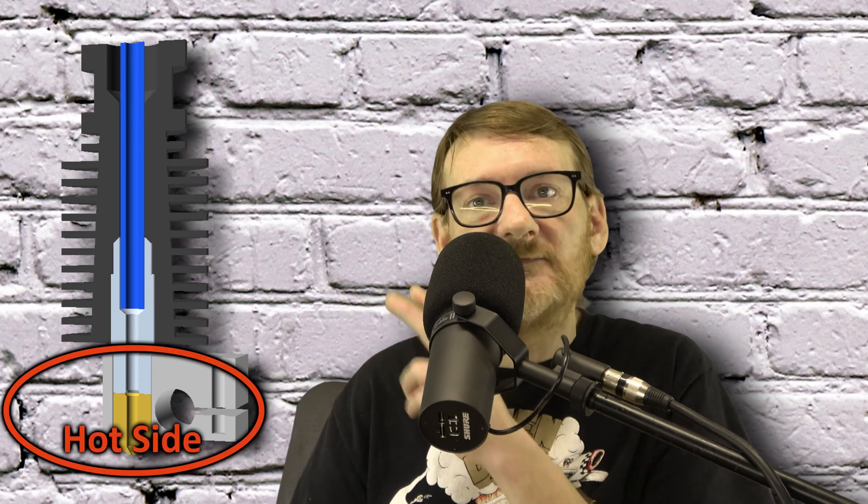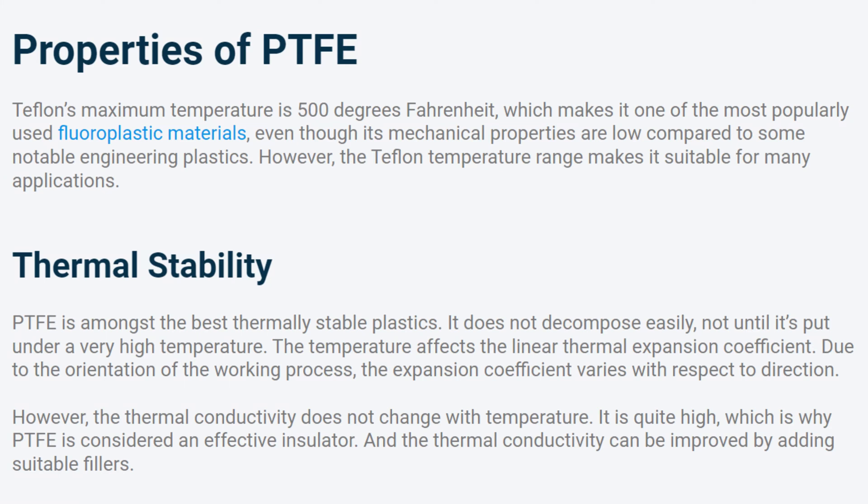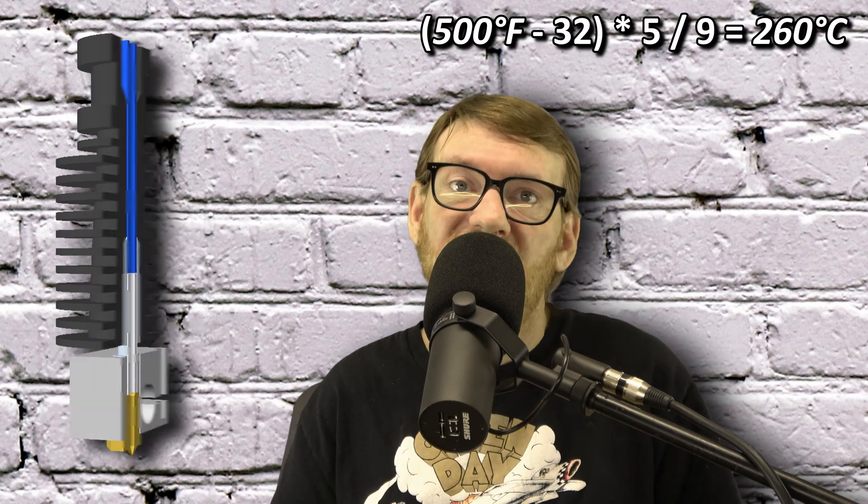As I showed in the previous video, the purpose of the heat break is to literally break the conduction of heat from the hot side to the cold side. When I made the last video, I was under the impression that having PTFE or Teflon tubing go all the way down into the hot side — even making contact with the nozzle — was a bad thing. Here's the thing about PTFE: it is stable and workable up to 500 degrees Fahrenheit, which is exactly 260 degrees Celsius. To maintain a slight buffer for potential overshoot and thermistor tolerances, our max safe temperature with a PTFE-lined heat break should be about 250°C. With most day-to-day printing — PLA, PETG, ASA, even most ABS — you likely won't need to exceed 250 degrees, so unless you're printing with polycarbonate or certain high-strength specialty materials, you won't need an all-metal heat break for temperature reasons.